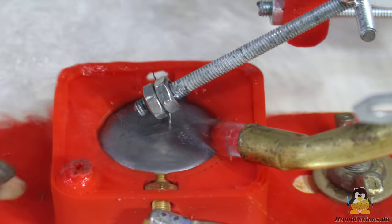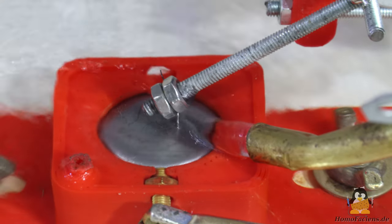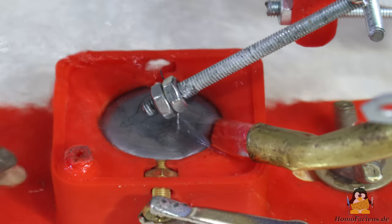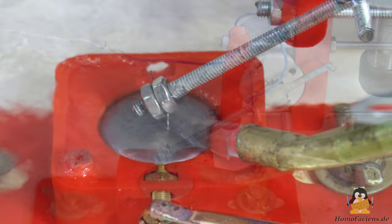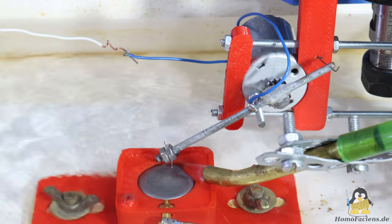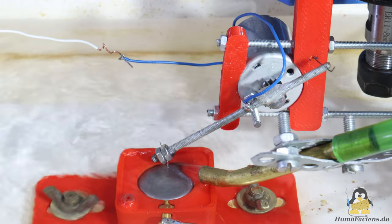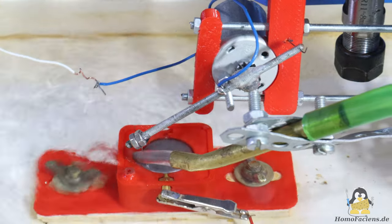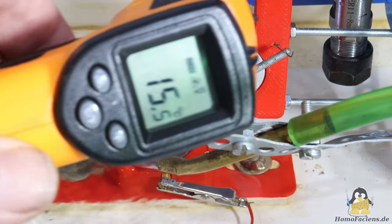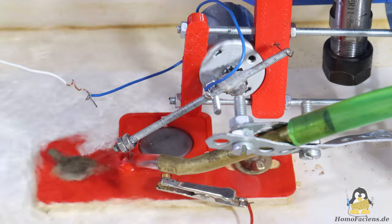The motor is operated in a mode for which it was never designed. The motor is constantly starting but only rotates for a fraction of a degree and is then moved back by the spring. The rotor never actually rotates. A too high current flows through the windings and cooling by a rotating rotor is completely missing. After the 5-minute engraving, the motor housing is not excessively hot and no smoke rises from the inside of the motor.